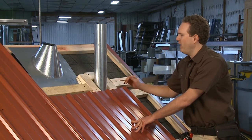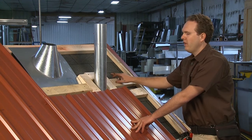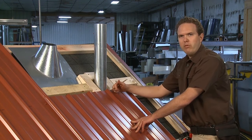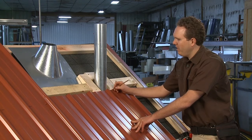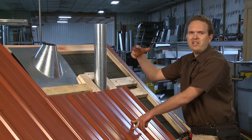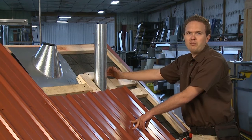To prepare for installing the first panel that goes under, I installed a couple of extra pieces of blocking along the side of this pipe to help catch the top edge of that panel so it's not just hanging there. I've selected a panel length that will go up just to the top edge of the hole, maybe a little bit past it. Now I'm going to measure to make the hole in the panel. For the side-to-side measurement I can line it up and mark directly on the panel, then set the panel down and pull my tape up just like I did for the PVC pipe. In this case it's going to be a U-shaped hole — you don't have to cut a full hole out because it ends right at the top where the pipe comes out of the roof.